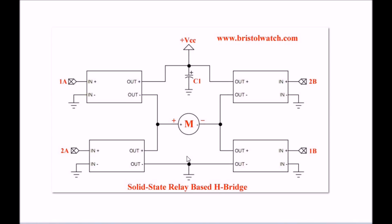Switch the other two on — 1A and 1B — and you reverse the path. Current flows from plus to minus of the 1A unit, through the other LED, and through the plus and minus of the 1B unit. Here is the actual schematic with the motor attached. You might want to put in a bypass capacitor. You could also connect another solid state DC relay between VCC and the circuit as a master power enable.